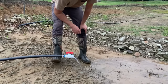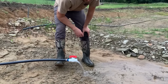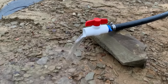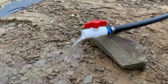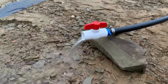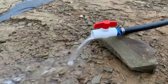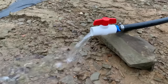It may stay a small trickle like that. I hear it gurgling. And if we go pull that spring valve off the end, it might come out substantially faster. So Doug's going to give us a whistle when he gets that foot valve off. We're thinking that spring foot valve is reducing our flow — we really only need that to get the siphon started to hold that back pressure. Once we get that off, hopefully we'll have a full one-inch pipe coming out of here. I just heard the whistle. It is definitely picking up in pace, so we're getting a stronger siphon now.